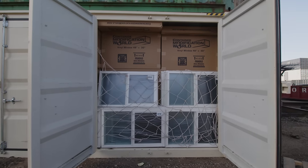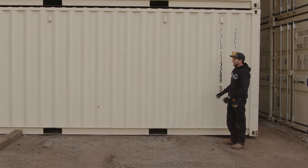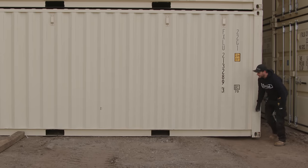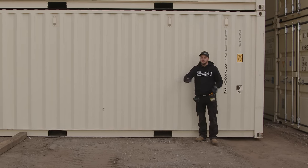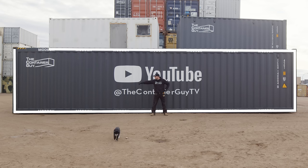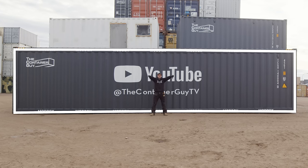If this container was fully loaded, especially aluminum shipping containers, so containers that aren't a steel structural wall, if there is a bunch of weight here and this is not touching here, it means all the weight's here. You can buckle a container. We do it, our yard is cambered. If we have an aluminum 53 and we set it in the peak or the crown of our yard, we buckle the side panels and completely total off an aluminum 53 foot shipping container.